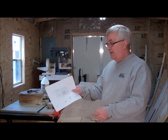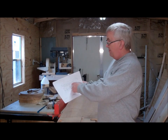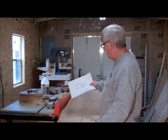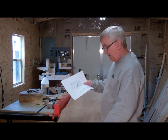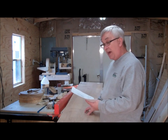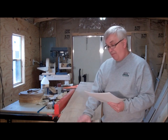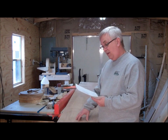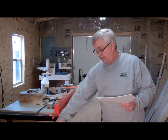I don't know if you can see this or not, but these end pieces, you see how they're flip-flopped so that you can get 8 of them across an 8-foot piece. And what I did is I went ahead and took this outside while my CNC router was making this template, and cut this down to 17 1/4, because these are 17 inches.